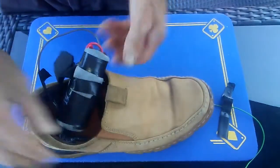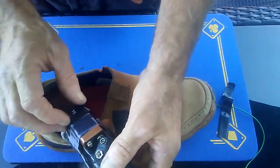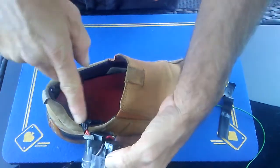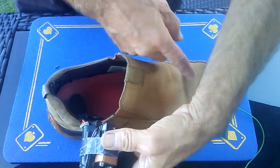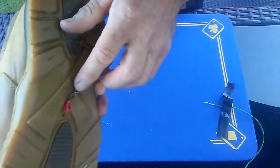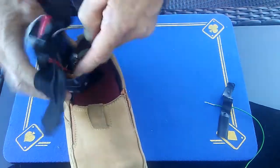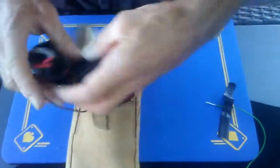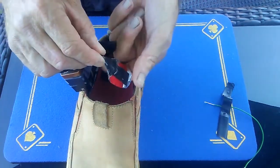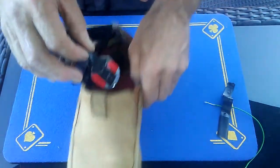Right, now you're going to have to dress it up and make it look a little bit tidier. I've just got a bit of pipe insulation as a bit of padding here, and everything is taped up. I've got my battery taped to it. I've got double insoles in my shoes just to pack it out a little bit. So on two of these wires, that's going down to the switch, which is where my toe is. That's what you're going to have to work on, the right position. And the other wire goes right through your shoe and comes out the bottom. And this plate here, this needs to be against your skin. So when I've got this on my ankle, I will just Velcro strap it around and slip this down my sock to my skin. It needs to be in contact with the skin, and a good contact, because sometimes it might arc a little bit if it's not really up tight against your skin. So when that's all set up, all you need to do is switch this thing on and you will be able to give somebody an electric shock.